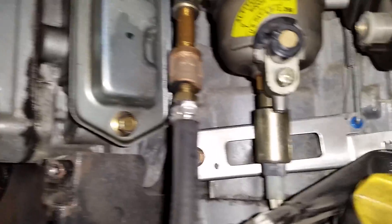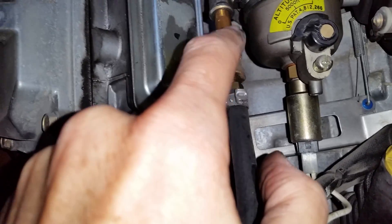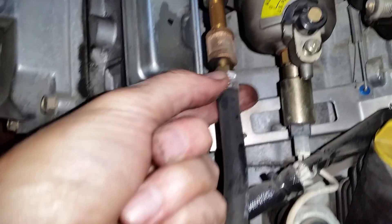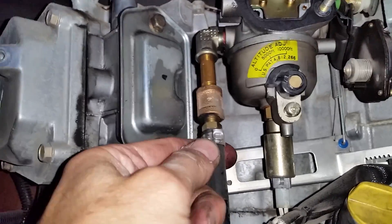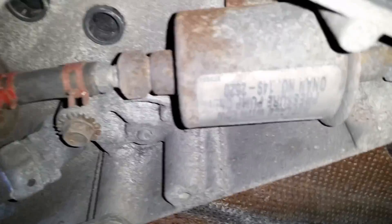You'll notice there's no fuel filter here. In the past, they had a weird fuel filter and fitting sitting here, and with the vibration these generators produce, they would sometimes break. So I eliminated the fuel filter there and used brass fittings with a barbed coupler and crimp-on connectors so it won't come loose — because the last thing you want is a fuel leak near a generator. I added another fuel filter underneath, a see-through one, moved it from hanging off the carburetor to before the fuel pump.